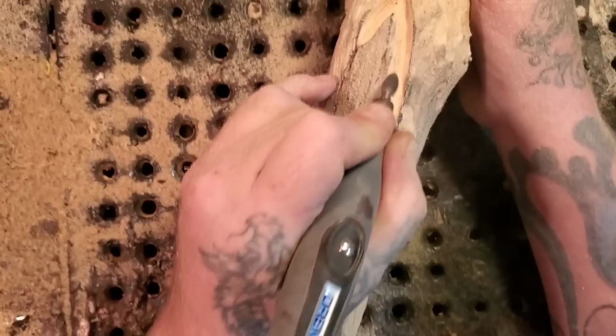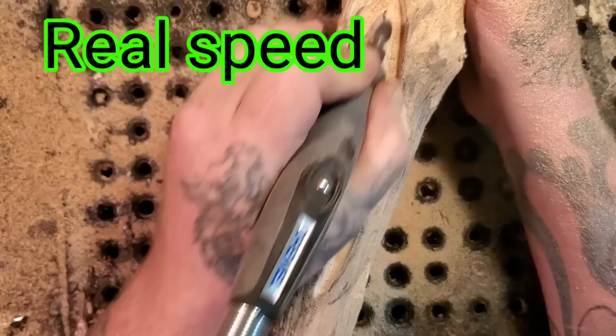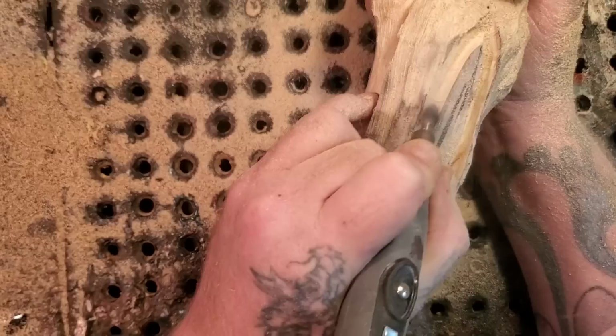See, I'm doing quick, but see how I do quick little passes. I run it in, so it's running when I go in and it's running when I go out. Like mowing the lawn. Take the first layer off. Don't clog up anything. Then go back and take off your second layer of grass. Lower your wheels. Right? But this, for instance, just take off more wood.